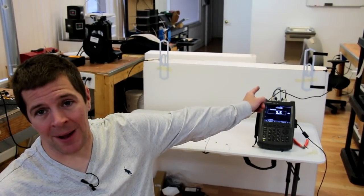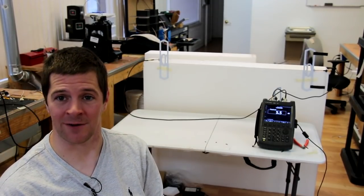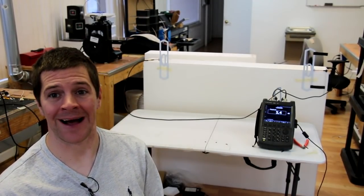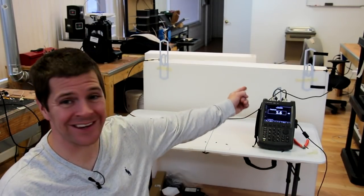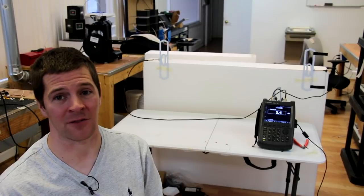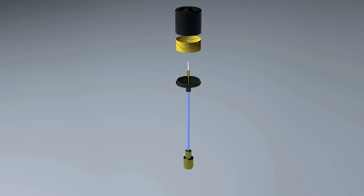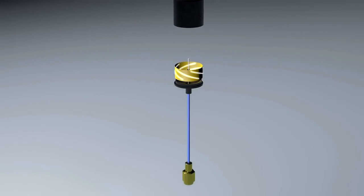The wire I placed behind that diamond antenna is known as a parasitic radiator. This is how the Yagi antenna works. In fact, that's what this is — this is a two-element Yagi. There are other instances of parasitic radiators, such as the case of the Minion and the Ion antennas, which use a similar technology to this one.